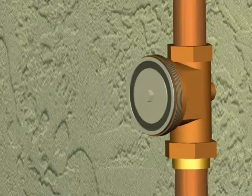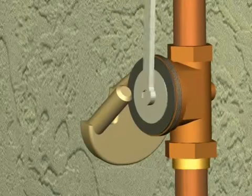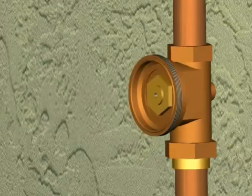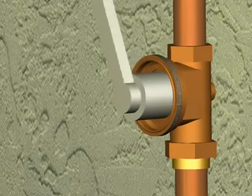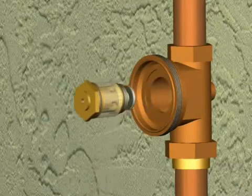If the valve is installed vertically, the parts may fall out of the bell when it is removed. You will want to hold the diaphragm against the edge of the body to keep it from rotating. Unscrew the bolt in the center of the diaphragm and remove the diaphragm disc and the diaphragm. The cartridge can now be unscrewed from the body counterclockwise by using a socket or a wrench.